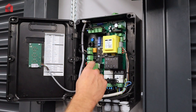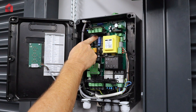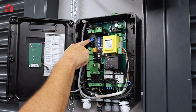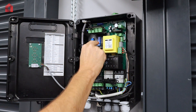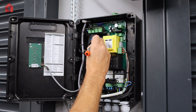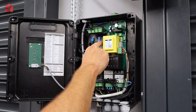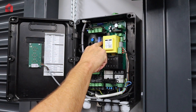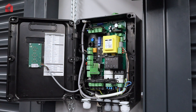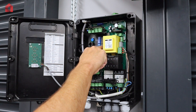The Promax has two banks of dip switches — one to nine, and one and two separately. Dip switch one is for auto close; just flick the switch on and use the variable pot to set up to four minutes. You've got dead man open and dead man close facility — if you don't have any safeties on the door you can put dip switch three on for dead man close. You can have a three second pre-flash before the door moves, a no brake facility if you don't want a motor brake, and no stop in opening — so if the door is going up the stop is inactive. You also have test open, test close, fine adjustment, and a select between digital limits and mechanical limits.